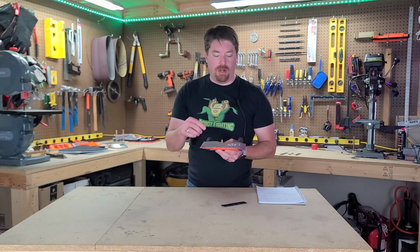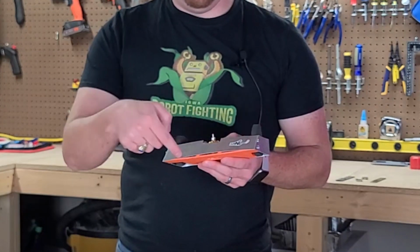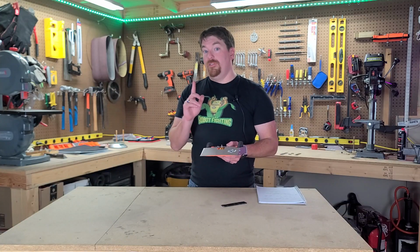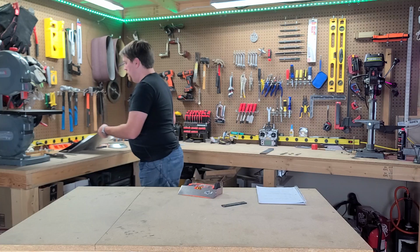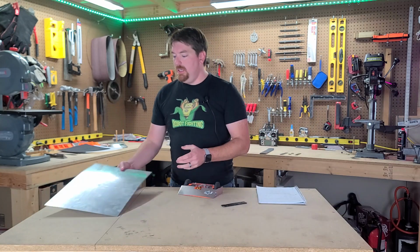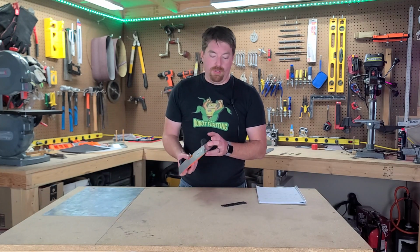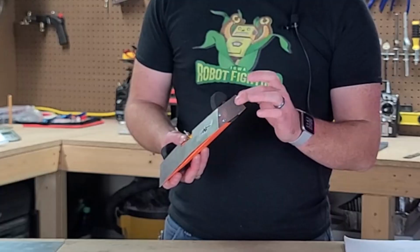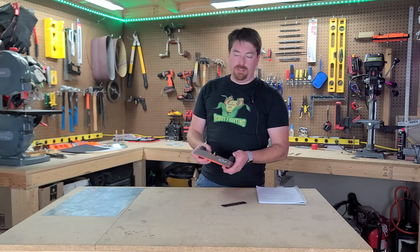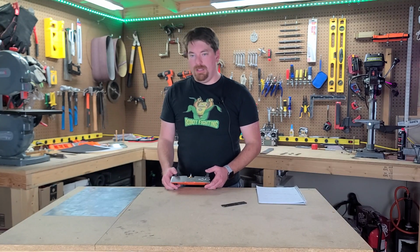Second change is outer armor. As I talked about in a previous video, this outer armor was a major liability right on this edge. The plan is to wrap the armor. If it needs to stay aluminum, it'll stay aluminum for weight, but if I can help it, I'm going to change my frontal armor to a piece of plate steel, and that should increase my durability for my plate. I will likely also replace my side armor and partial rear guard armor with UHMW panels. I'm looking at being able to bend those, and that might be coming up in the next video. We'll see. It depends on where we get.